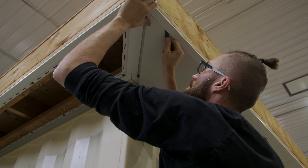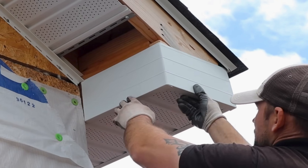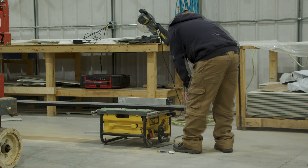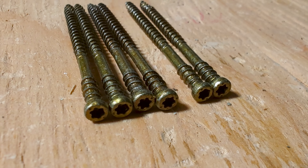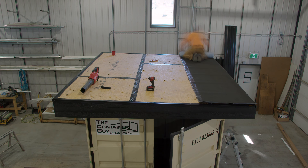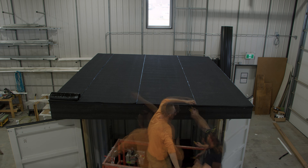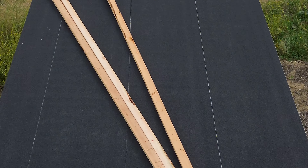I love challenging the traditional way of doing things, and I love the uniform look of solid white PVC panels up there — the truss design of these PVC panels can span a couple-foot eave with ease. The thin aluminum fascia typically used around here doesn't scream quality, so we used a composite board instead, which provides a classy cedar finish while adding structural integrity. We use special GRK fasteners meant specifically for composite trim boards. This roll-on asphalt roofing system is an easy-to-change system going to a potash mine to prevent potash particles from pitting the flat steel roof — and that is why we're building this flat roof on top of another flat roof shipping container. This was all made possible by using Container Modification World's new truss bracket kit.